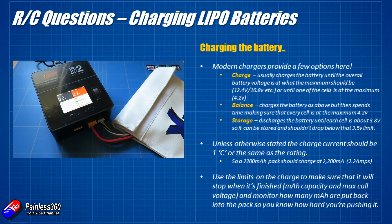The last mode is storage charge. You don't want to put LiPo batteries away when fully charged — they will very slowly discharge. If you come back from the field and haven't flown on a pack, put it back to storage charge before putting it away. If you're going to use it within a couple of weeks you can leave it fully charged, but otherwise put it down to storage charge. Storage charge puts each cell down to about 3.8 volts, so even if it gently discharges while packed away it won't fall below 3.5 volts and won't strain the cells by storing at full voltage.